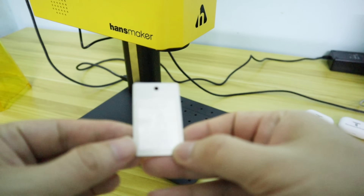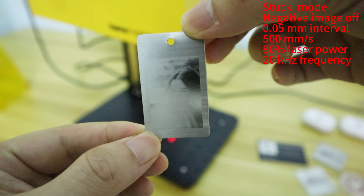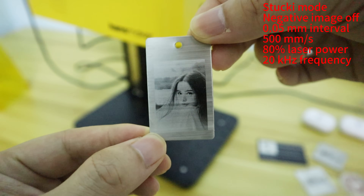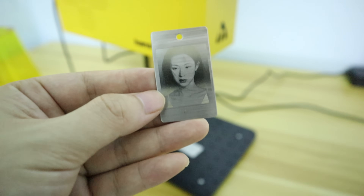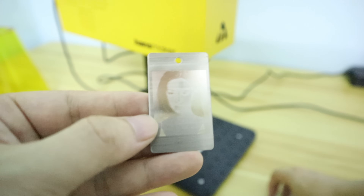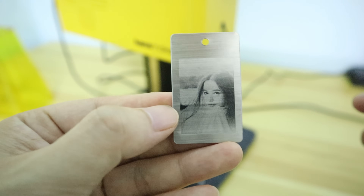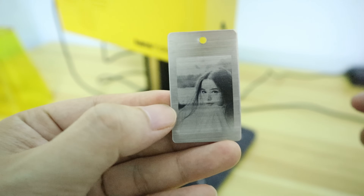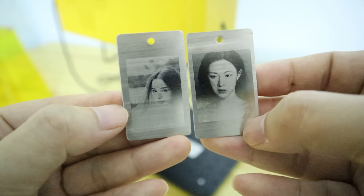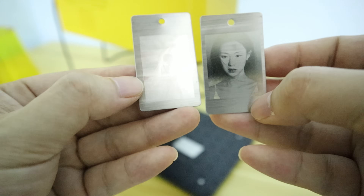The high-definition results were achieved with the following engraving parameters: stucki mode, negative image, 0.05 mm interval, 500 mm per second speed, 80% laser power, 20 kHz frequency, and one pass. The reason why the F1 Pro can achieve such high-definition engraving on stainless steel is that it has 0.001 mm engraving accuracy and 0.045 mm laser spot size. Additionally, stainless steel, compared to other engravable materials like acrylic, is less likely to undergo excessive combustion at high laser temperatures, and therefore can achieve a more perfect engraving effect.